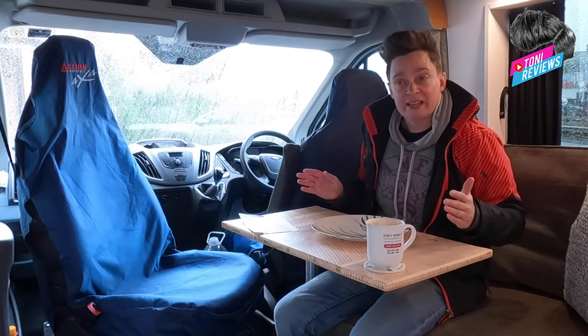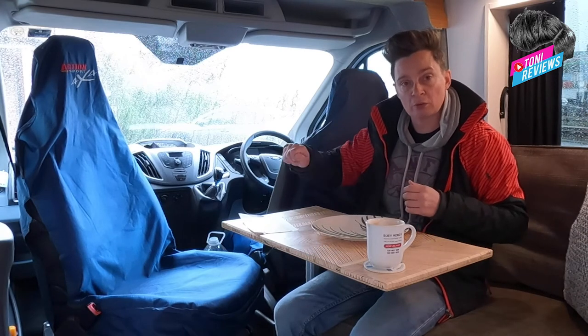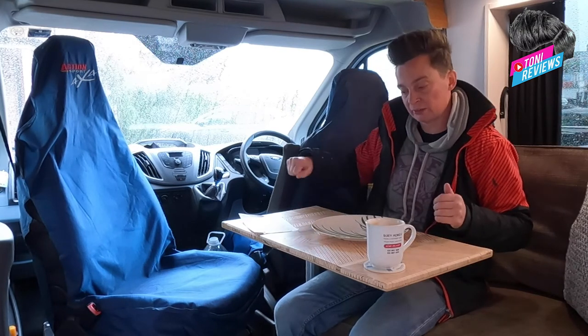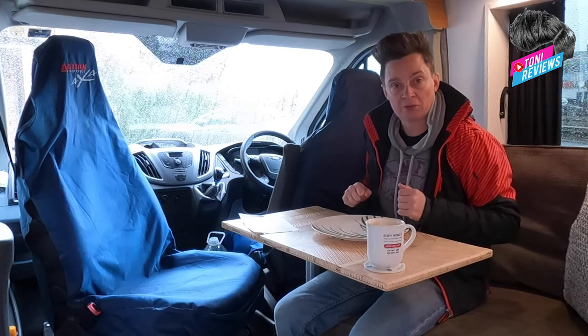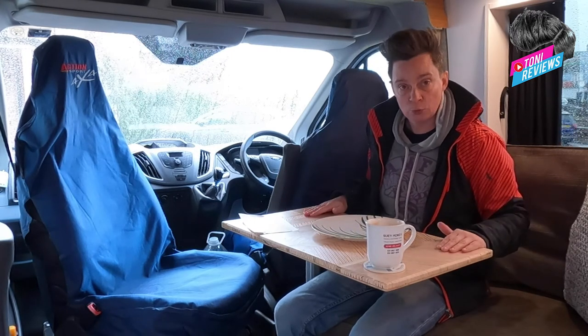Again, in terms of my sander, I had my little palm sander, and then at the end I finished off with a block of wood with a 240 grit. If I could have got my hands on one, I think a handheld belt sander would have been a great way to get a nice flat finish across the table. That would have been another little added bonus.